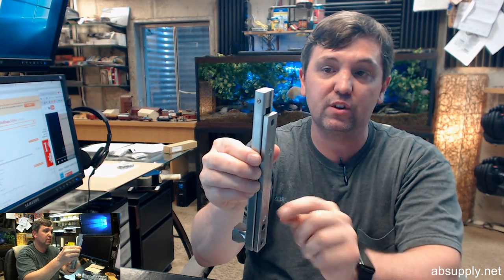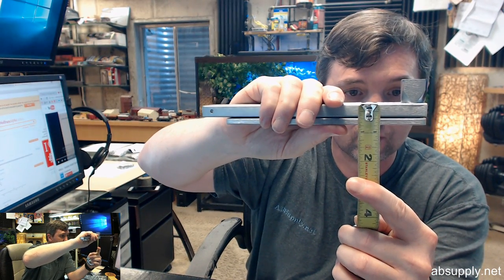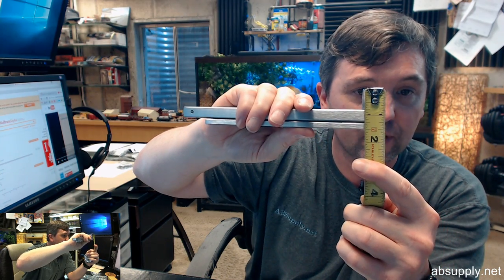Attach the bolt guide to the door, which again is this after I removed this item. Slide the bolt head over, put in your end filler cap, and tighten that down like I had said earlier. Align strike with bolt and fasten. So get the bolt located where it's going to be, then position the strike, mark those holes, drill them, attach the strike, top or bottom, wherever you're going to go. Now, a lot of people will like this 597 bolt because it's clean. It's a clean installation. It doesn't have exposed fasteners, and some people just simply prefer it. I did not give you the overall thickness and then projection. So it's about 3/4 thickness, and then to the end of the knob, you're at about 1.5 inches.